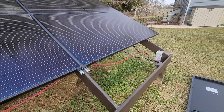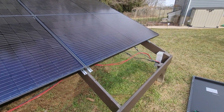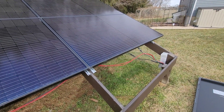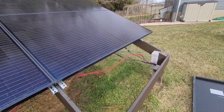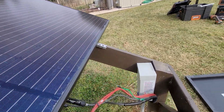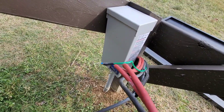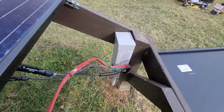It's not going to fully charge the system. We're running about a 10 kilowatt system right now, and it's about 600 amp hours of batteries. I have all the strings running into a combiner box, and once I start wiring this up I'll open that up and show how I wire everything.